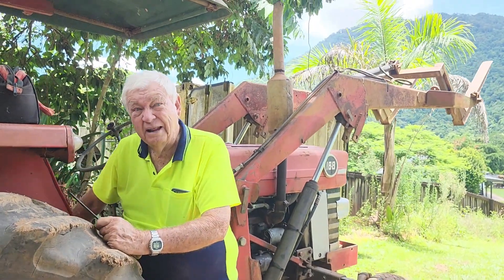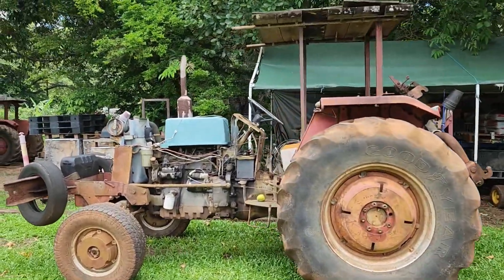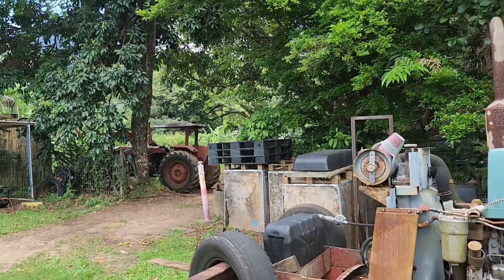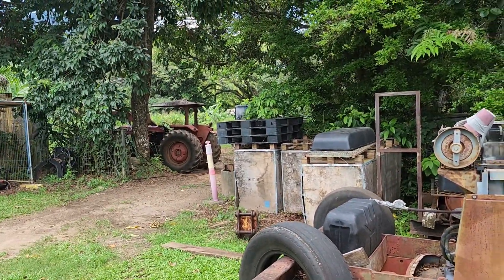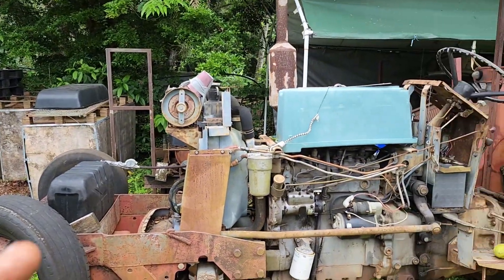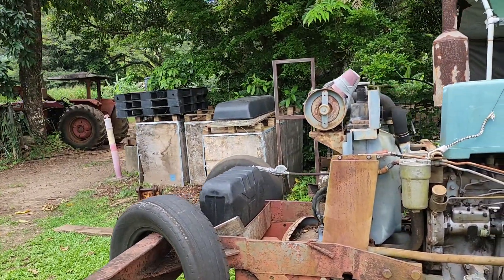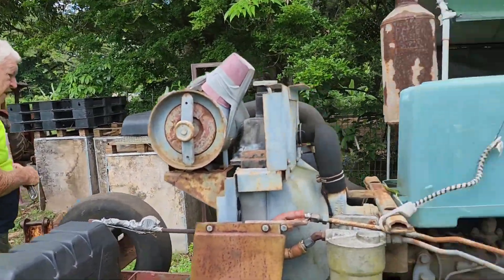It was pumping a little bit — I managed to get it up that high. This is a Massey Ferguson 188, and the other one there that we just did is the same. But that one is probably a year or so older and it's got a different pump and filter inside — you can tell from the serial numbers. Most things are interchangeable but the pump is not.